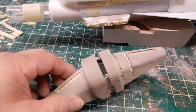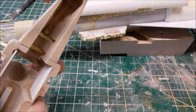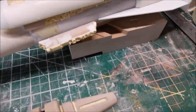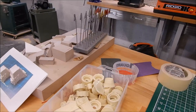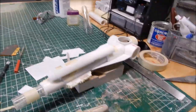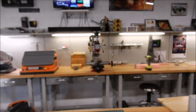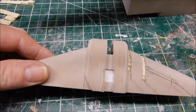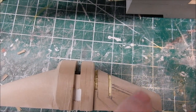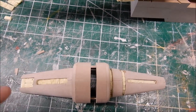Here is the head — I added some details to it, beveled the edges, and cut it. The basic shape is a block, a very tiny block right here, with a great big old block sitting on top of it. You can cut it in a bandsaw or mill it. What I do is draw this profile on a block, then cut it in the bandsaw.